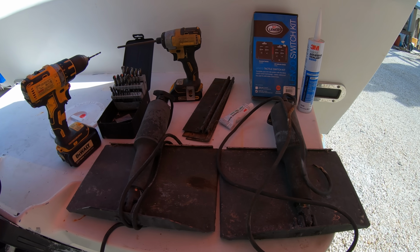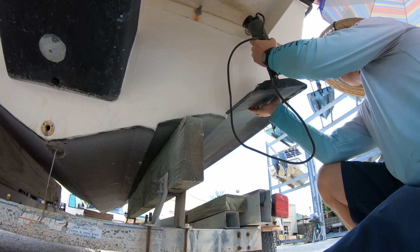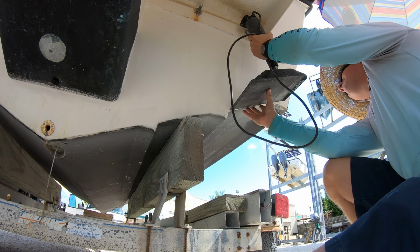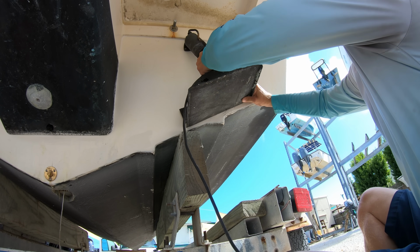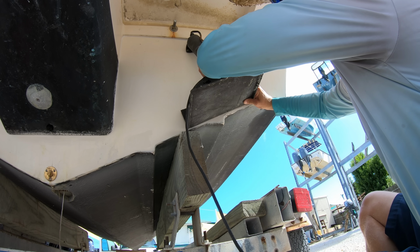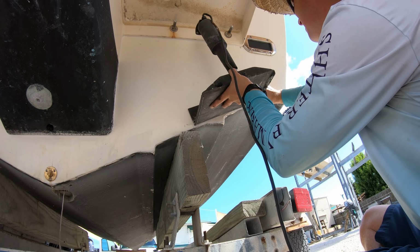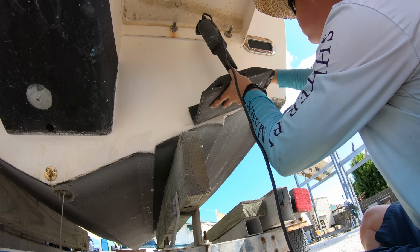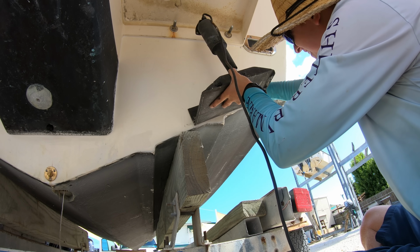Installing the trim tab system is pretty basic as well though. We want to get our trim tab planes positioned as far out on the boat as we can. Sometimes you can't get them all the way out to the sides, which is completely fine. They are going to work fine being moved in a little bit. We are putting these inward toward the keel on the Ocean Master because we want to have the wires under the deck and not running along the back of the boat.